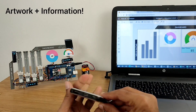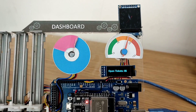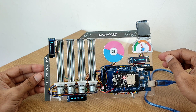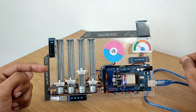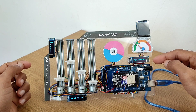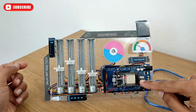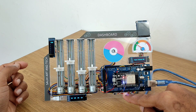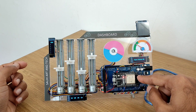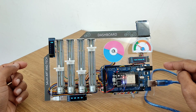It can also be powered using a mobile power bank which can easily be recharged. I will share a little bit of technical details. I have written the program in Arduino. I have used two stepper motors for the meter chart and the donut chart. Four other stepper motors are used to represent the bar chart. The mini display shows y-axis values and x-axis labels which get adjusted automatically. The ESP32 board is like the heart of this board — it connects to Wi-Fi, gets information from the API, and passes it to the Arduino Mega through serial communication. Once the Arduino Mega receives the information, it splits it and controls all the hardware depending on its values.